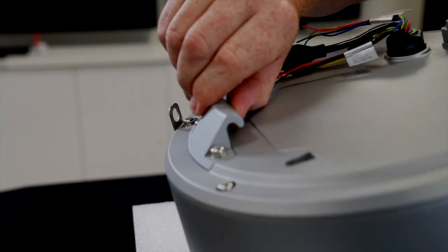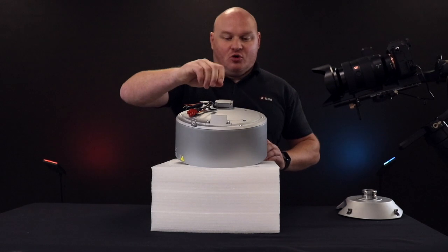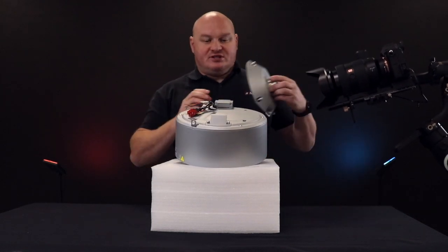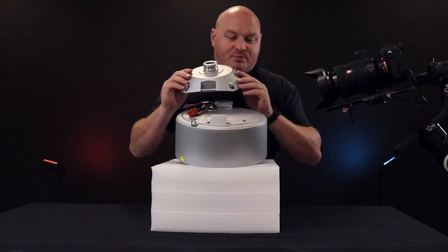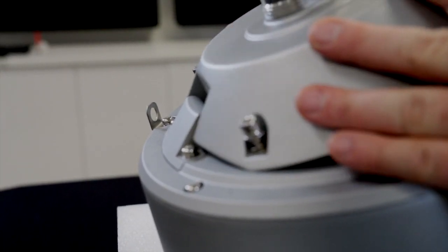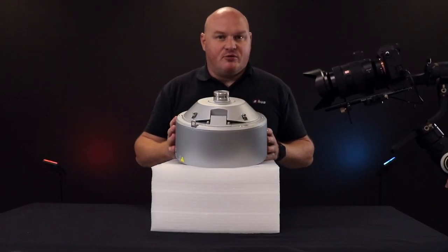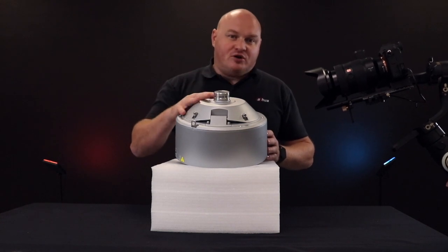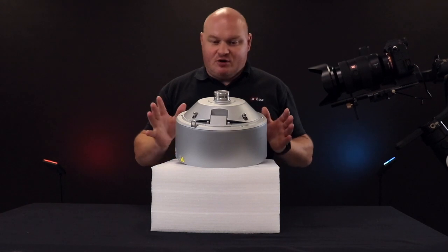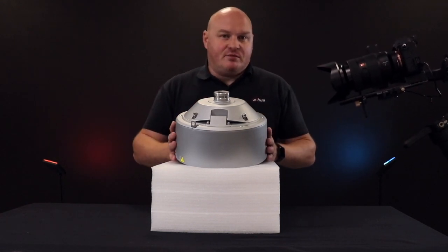What I really want to talk about is this hook on the actual back. This hook completely supports the weight of the dual PTZ. What we use is our detachable hood — we put this into place first, then we mount that on the actual camera, click it into place, and push down the strong bolts. It only requires one person to install this camera, not two. I installed it single-handed with the power supply and the network cable and was done in five minutes flat.